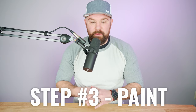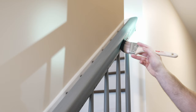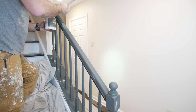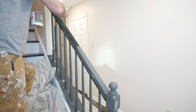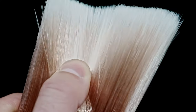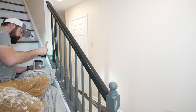That'll give our finished paint the best chance to be as smooth as it can be. An excellent combo we have discovered is using the Fresh Start primer with Benjamin Moore's Advance trim paint in semi-gloss. That combination will get you amazing results if you lay it down correctly. Advance is an excellent choice for handrails for a variety of reasons. It's a hybrid trim paint, which means it's got oil resins pumped into it, so it's going to perform quite a bit differently than say 100% acrylic paint. Because it's a hybrid, it's going to level out really nicely, and it's also going to have an excellent amount of adhesion and durability, particularly once it cures out. When I use Advance, I like using soft-bristled brushes like the Corona Vegas — it's got champagne nylon. There are a lot of other companies that make soft-bristled brushes as well that do well with this paint. It just tends to lay it down really smooth and gives that product a good chance to level out.